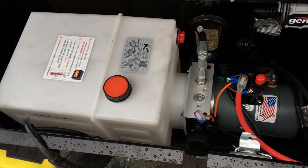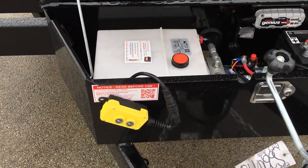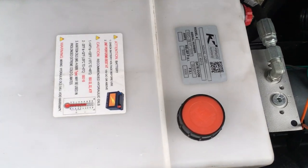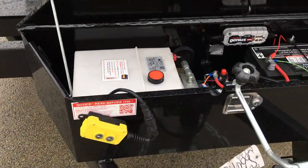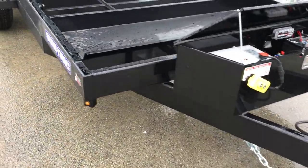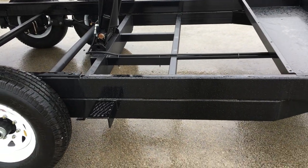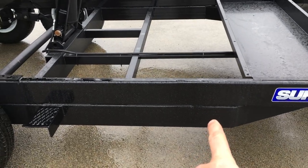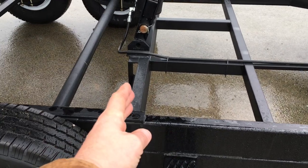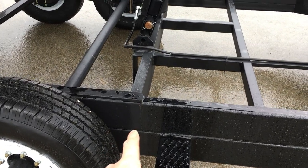The pump is a power-up gravity-down with an oversized reservoir for the gravity-down system. They've got the pump pressure set at 3,000 psi on this unit. It's got a 6-inch tube tongue and 6-inch tube mainframe. One thing ShoreTrak does differently than some in the industry — typically the tongue would not be a full wrap, but they do a full wrap, which is a nice design. They've got the bulkhead set back farther than some, so basically the tongue terminates where the bulkhead is.